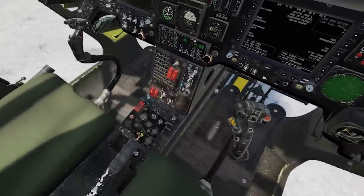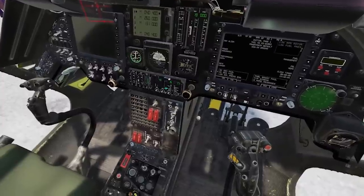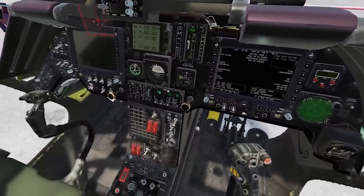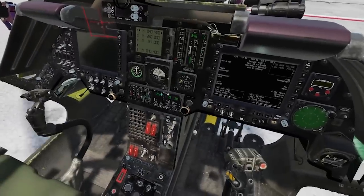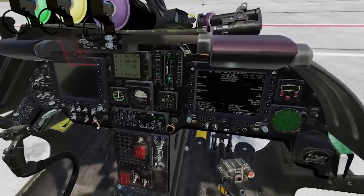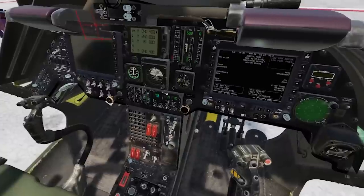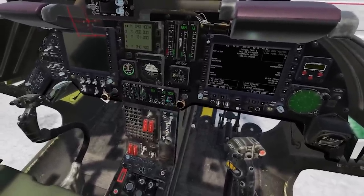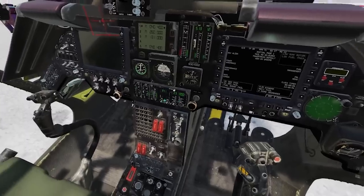I hit the start/stop timer, count a few seconds, and release. NG is on the rise. I need a minimum of 14 volts by 10% NG — we have 17 volts and holding. Light-off at 11%, TGT is on the rise. By 18% NG I look over at pressures and temperatures moving. By 20% I need blades turning by 25% NG — all of which is happening. I have my initial and secondary peak on the TGT; now it's stabilized and coming back down. Waiting for start volts to drop to zero at 55% NG, indicating FADEC has released the starter — self-sustaining fire confirmed. Engine stabilizing between 63 and 65% NG. TGT is stable — looks like a good start.